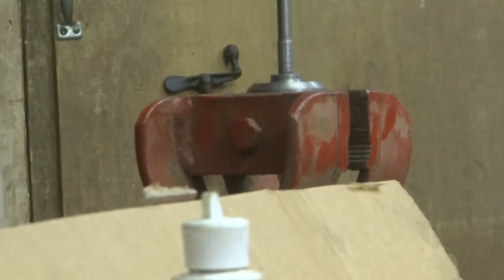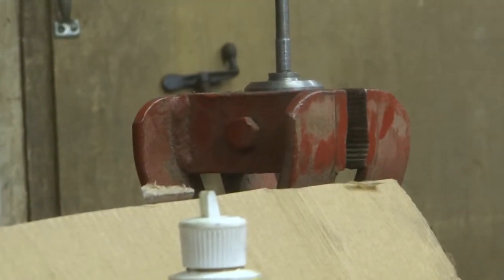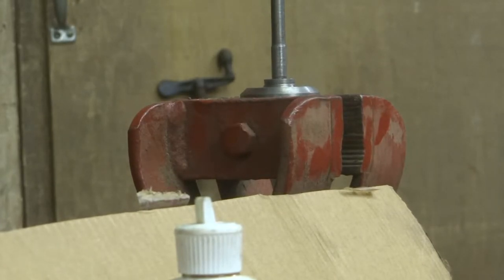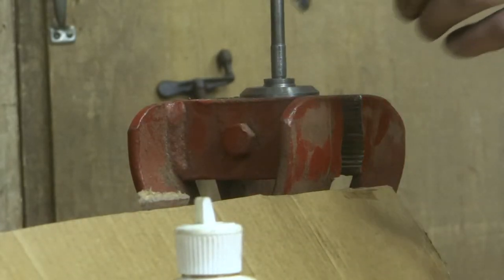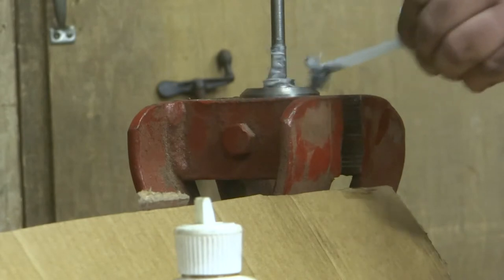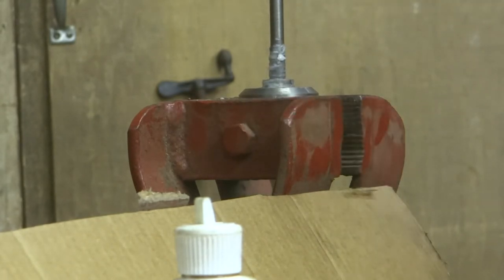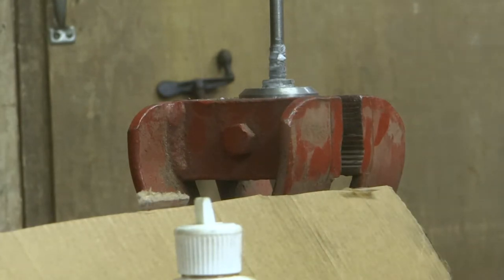Okay, if you haven't ever silver soldered before, in the real world, I do refrigeration for a living, and I use 45% silver because it gives a better bond for the refrigeration joints. So you have to flux it, and 45 is better than 25 has been my finding. And I'm just setting up the torch, so...